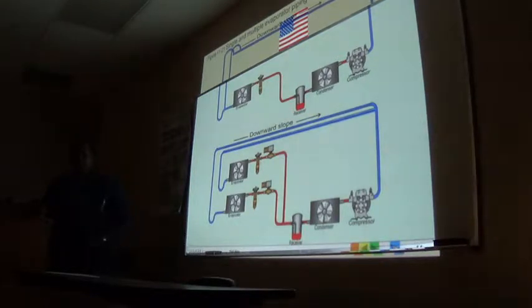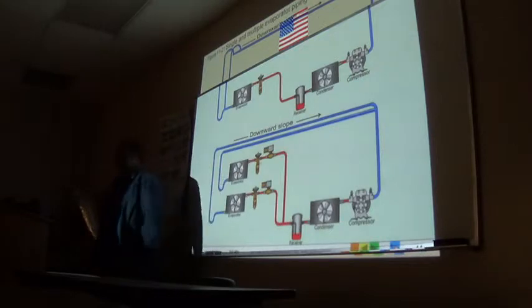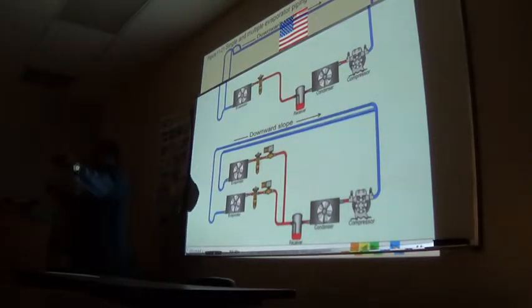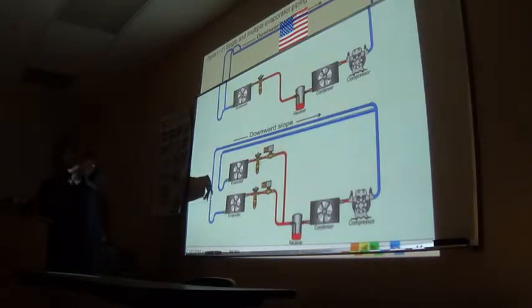And the thing with certain warehouses, it may be milk. So if you lower the thermostat on each one of them, you may freeze the milk by the time you finish the service call. I work on some of these milk distributor warehouses, and that's one of the biggest challenges: not to freeze the product while you're doing the service call.